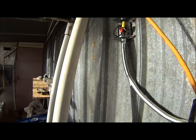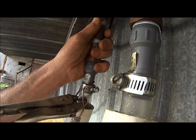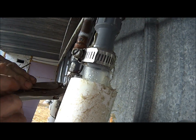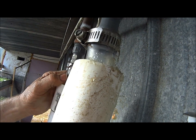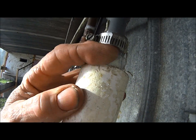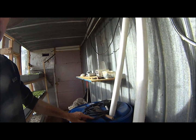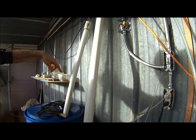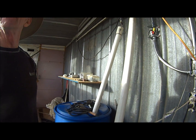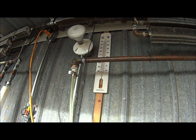This is a return pipe. If I take this fitting off right here, all the water came back just through the first pipe, but all of it would run into this one tank and it couldn't equilibrate fast enough. So I put pliers on it to squeeze it down so the water comes down both pipes and they both heat up at the same time. That one wasn't even picking up the heat in the room because it was loose.